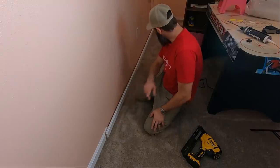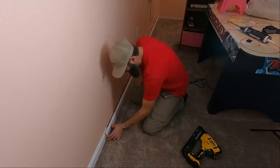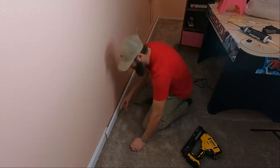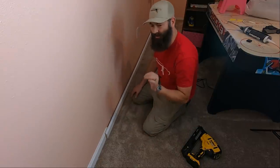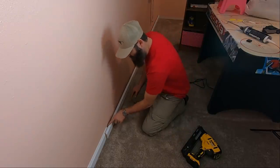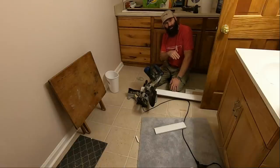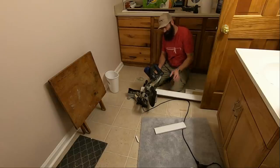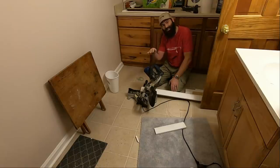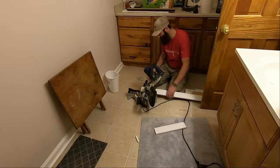So this is the next 12-foot run and it's going to go straight into that wall. I'm going to cut another 45 going this way — just line it up here, mark that line. Just a very slight spring to it, meaning it's going to be just a hair longer because you don't want this prying this off the wall. My first cut, I'm going to cut a little long, then see how close I got, and shave that last 16th of an inch off a little bit at a time until I'm right at my mark.